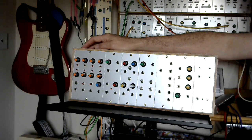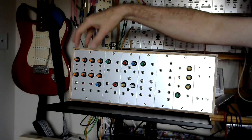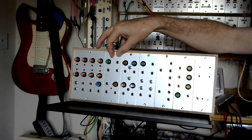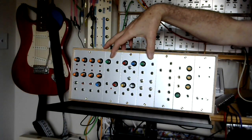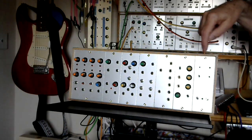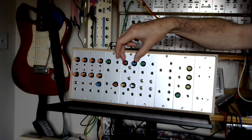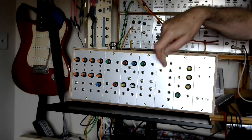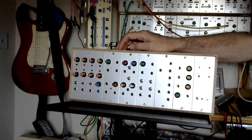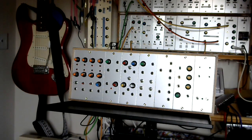So in summary, working back: you've got an eight-step sequencer, a square-wave VCO, and a triangle and pulse-wave VCO — so it's a dual VCO system. You have a Vactrol and a low-pass gate, so dual VCA. You have a looping envelope, a VCF, a sub-octave generator, a patch panel, and a three-channel mixer. And that is a basic setup of Project 920, DIY Modular Analog Synth.